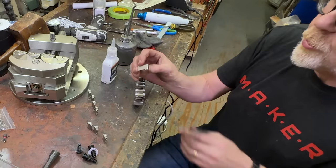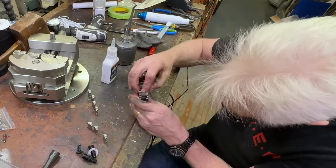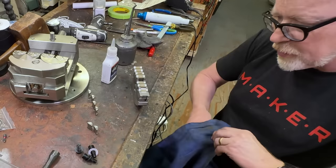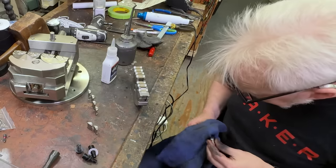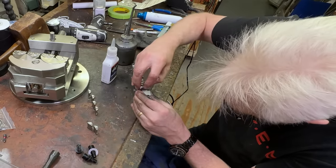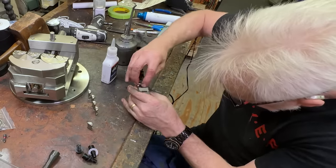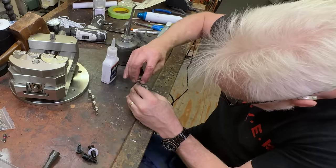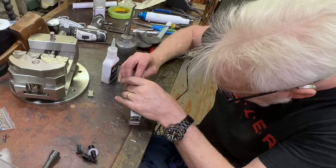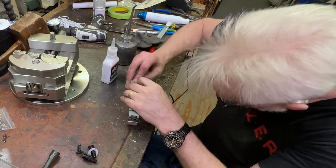So one thing I may do is I may actually machine a V in the middle of these final jaws to create just a little bit more of a landing surface. Oh, that's nice. There definitely was some grit in the oil this was packed in, so it's nice to remove it. I may end up getting a little lapping compound in there. Oh, such gorgeous things. They actually seem to be interchangeable parts, which is remarkable.